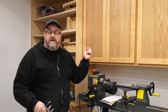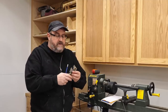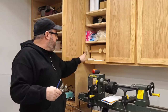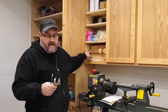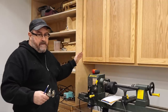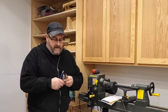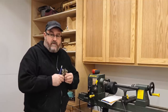Before you build the doors, you need to know how big they have to be, and that's largely dependent on the type of hinge that you're using. In this instance, I'm using these, which are concealed European style, and they mortise into the back of the door here, and they mount on a plate on the inside of the cabinet there, and they overlap the frame on the hinge side by a quarter inch. You have to look at the hardware you're getting, because there's going to be quite a variation. You need to know that before you start building the door.